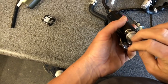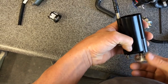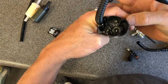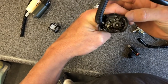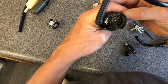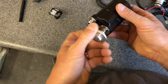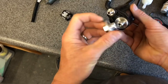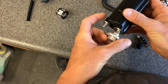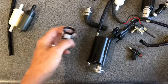Back to this big anchor nut — it's just an anchor nut, and looking down in here you'll see a little indentation where the snorkel fits down, and that's where your fuel is drawn into the bottom of the snorkel on the pump. There's a hole in the anchor nut that I'm not entirely sure what it does — it's a dead end and they probably could have made it without the hole, but maybe on some applications it serves a purpose.